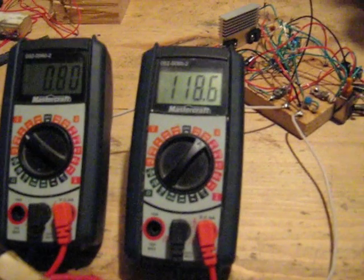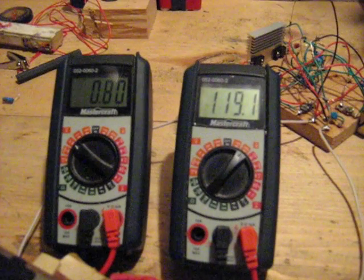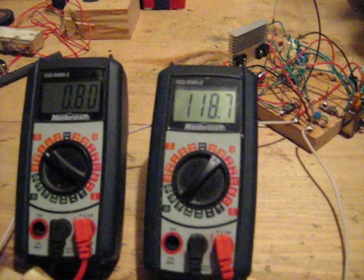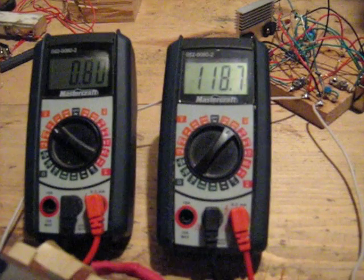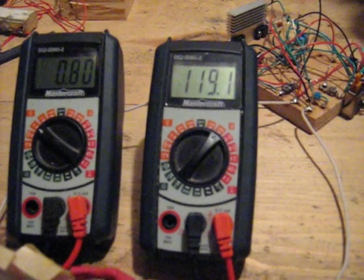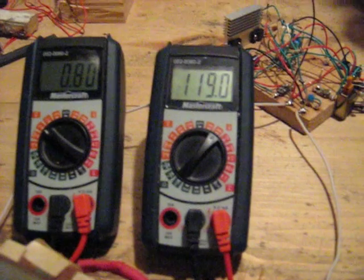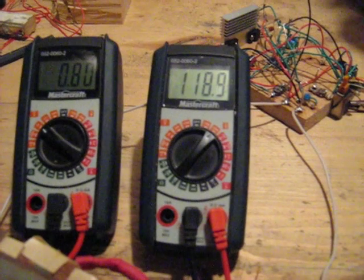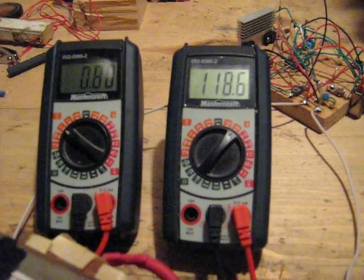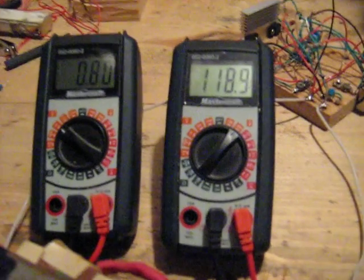I played with my thing trying to figure out what the top and bottom end of the frequency range is. I downloaded an oscilloscope and spectrum analyzer program — I already had the signal generator — but it gave me false readings, so I played it by ear with my signal generator. It was much lower, closer to where I expected. I got my guitar tuner out and turned it on at its lowest frequency setting with a speaker hooked up to it, and it registered in A sharp. I looked that up online and it said 466 hertz thereabouts. So I'm thinking my bottom end is somewhere near 466 hertz, for anyone who's interested.